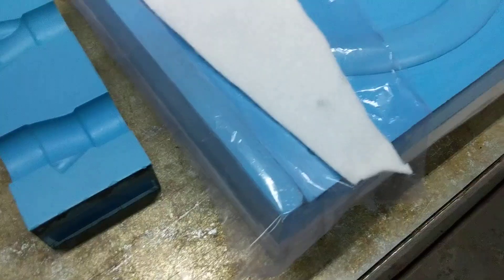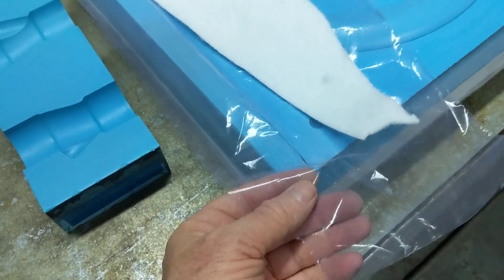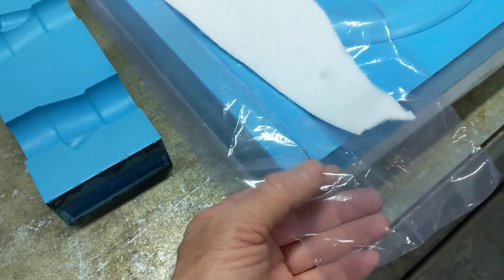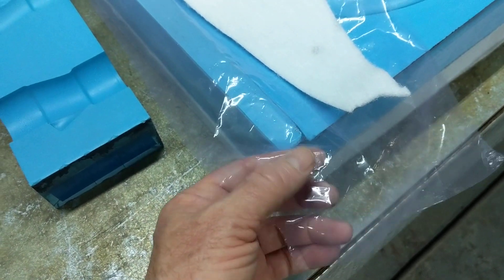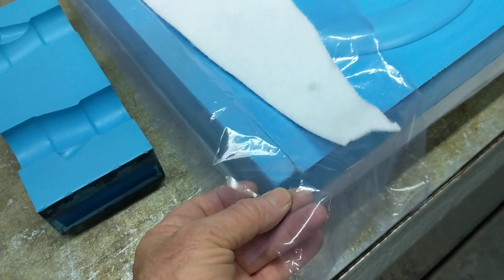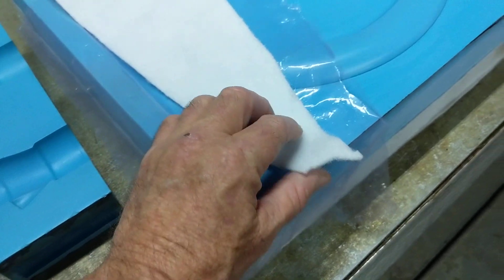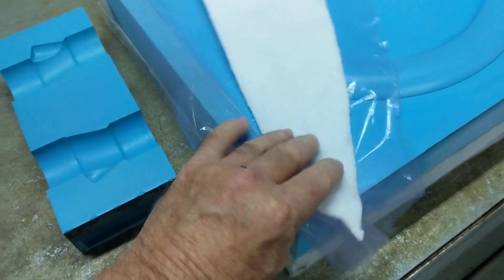This is all very common parts. Here's what I use for the inside of the part. So this is just P0 release film — it has no breather holes in it at all, so everything is edge-breathed. Breathe everything out to the edge of the mould. That's the mould surface itself, and then this is just the breather on top of that, and that goes in the bag.